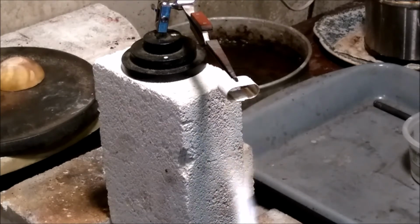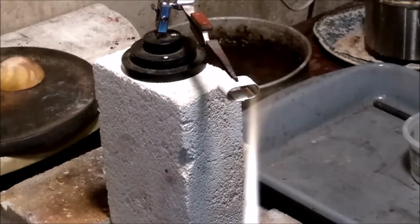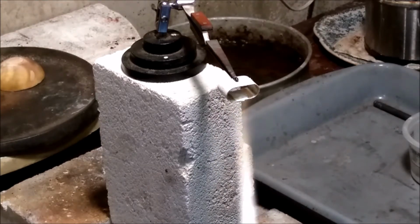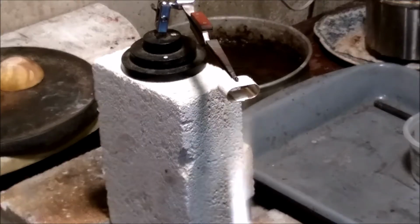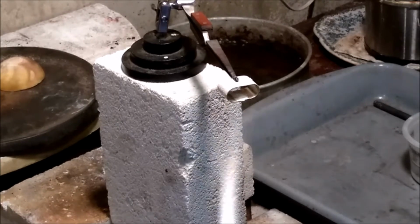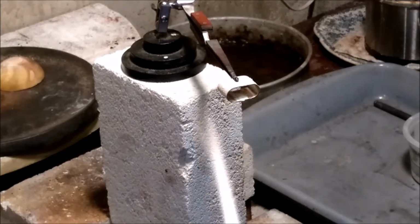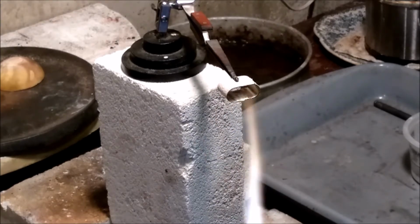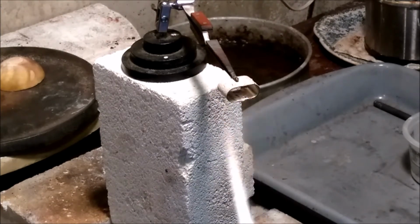It'll oxidize and turn black because it's sterling. If I coat it with the same flux, borax flux, it won't turn black. So you want to keep the heat moving back and forth. Slowly heat the whole piece up until the metal gets hot enough to melt the pieces of solder that are inside there. There's 3 pieces. They're long ways over the seam, using hard solder, because later on I'm going to use medium and easy, or you can use hard all the way through. Hard silver solder all the way through your project if you know what you're doing. Otherwise you use hard first, then medium, or soft. Your bail is made kind of separately anyways.